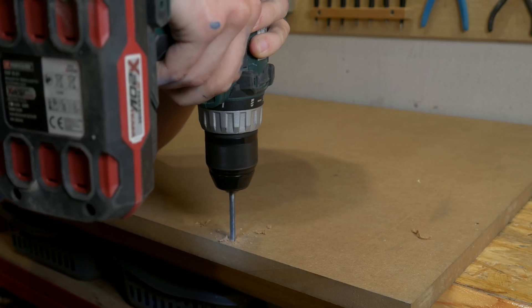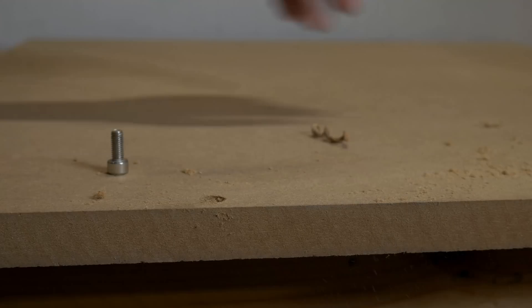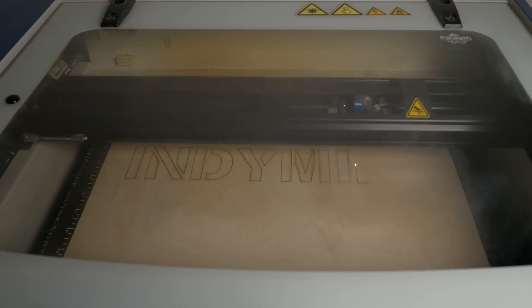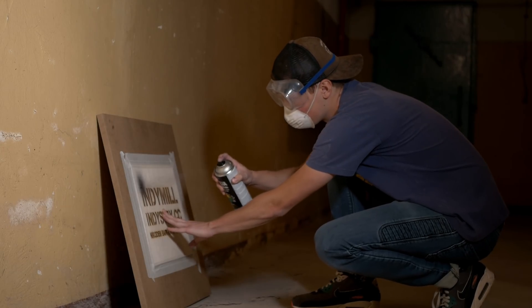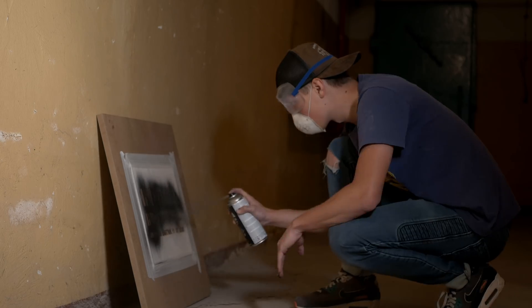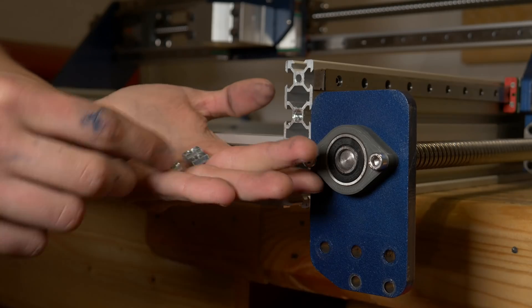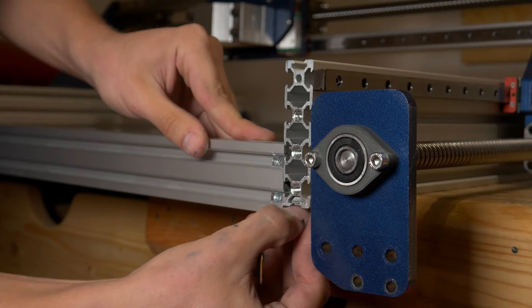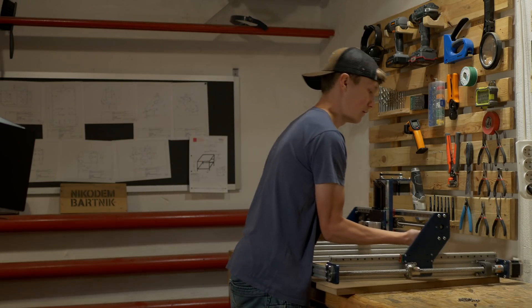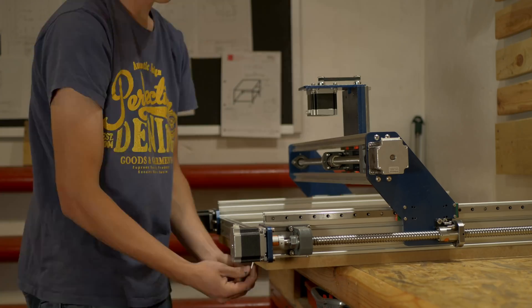For the wasteboard of the Indie Mill I used the same 18mm thick MDF — a 64 by 60 centimeter board. To make it less boring, I cut a stencil on my laser cutter and spray painted something on top of the wasteboard with matte black spray paint, and it looks really cool. To attach the wasteboard I drilled holes in it, then disassembled the Indie Mill slightly to put T-nuts below the aluminum profiles. It's quite tricky to position the T-nut precisely in the aluminum profile, but it's easily doable — you just have to try a few times.